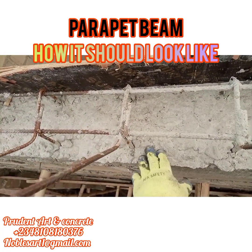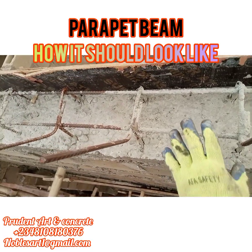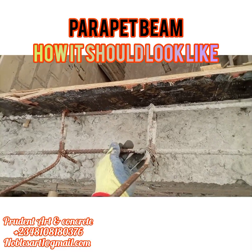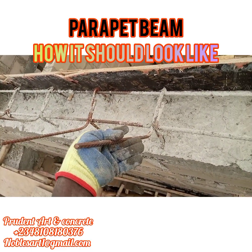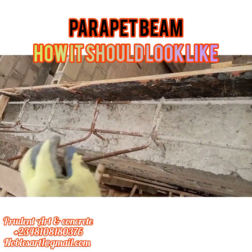We still have another two irons down in the concrete. This one has been casted a few days ago, so it is already very solid and very strong. We use 12 mm for the main rods, then 10 mm for the ring. You can see the interval — it's also a 9-inch interval, but we have external iron.